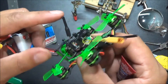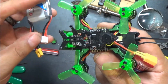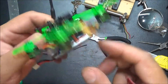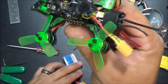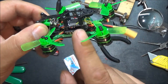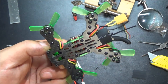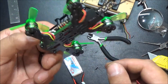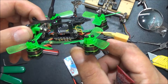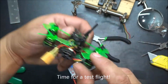Now that I've got my new Fat Shark goggles, I've got DVR capability within the goggles themselves, so I'll actually be able to record some video flying this little sucker. Thanks for watching guys — it's a nice easy fix. Just replacing a motor: take your standoffs off, pop your flight controller and ESC out, and solder those in. It takes all of 10 minutes and you've got a new motor on there. I'm going to hook it back up to Betaflight and make sure everything's calibrated before I do a flight. Make cool stuff — later!